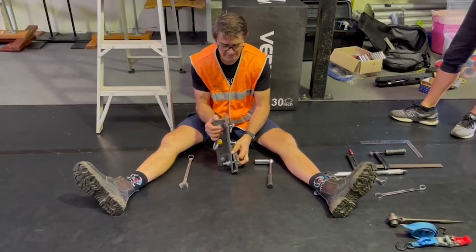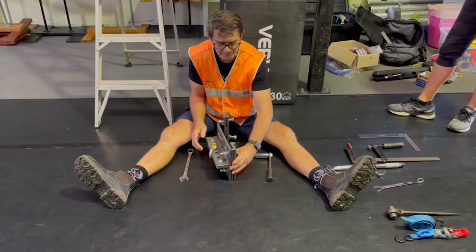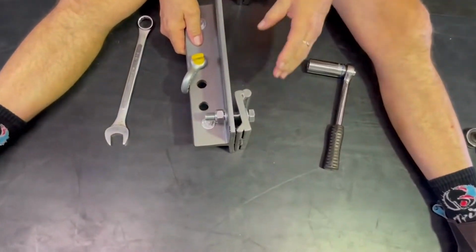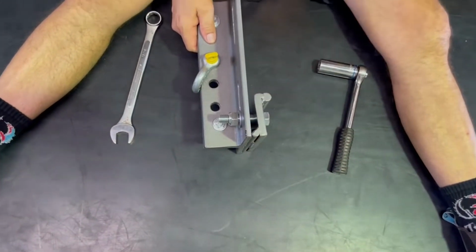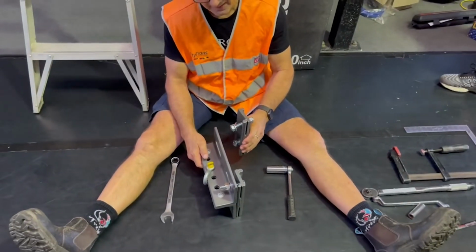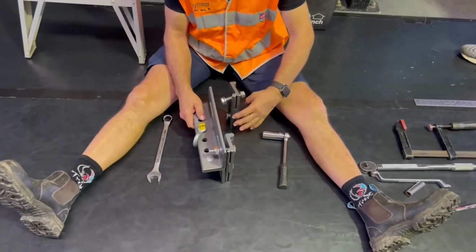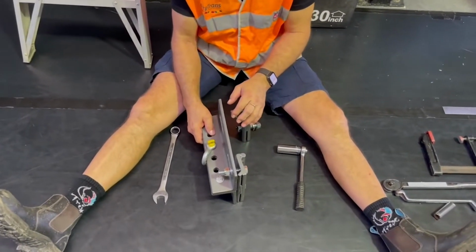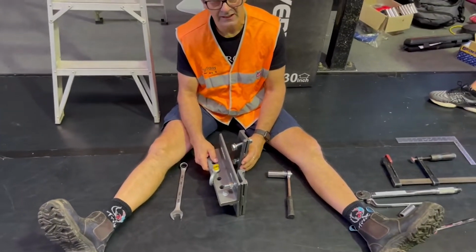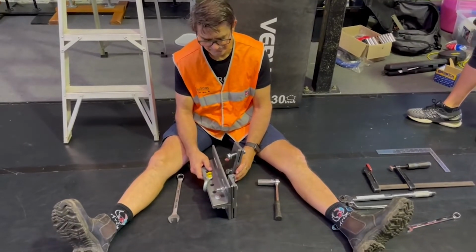Once you have placed the first top part in place, we've got enough space for the beam flange to fit in there. We are now ready to start the installation up on the high beam. We prepare the second top section as we did with the first. We're just getting the bolts prepared, so once this is in place, we'll be able to slide this into the correct position, slide the bolts through and tighten them, before we finish the final part of the install.